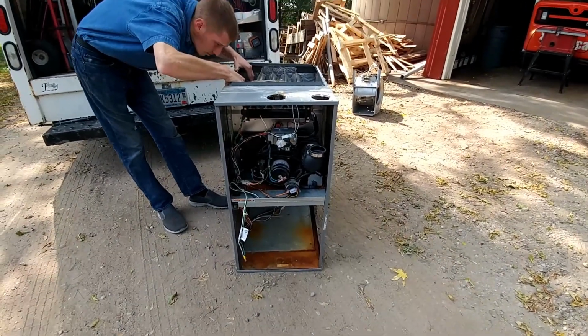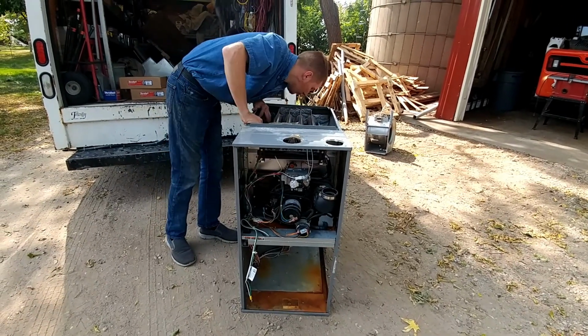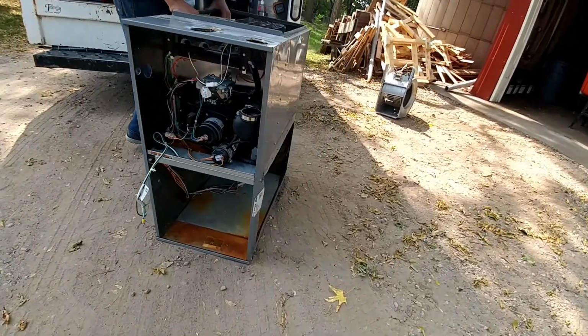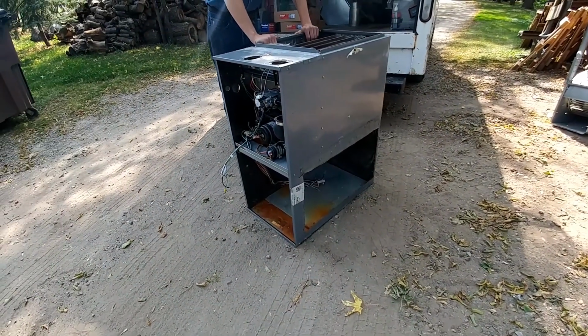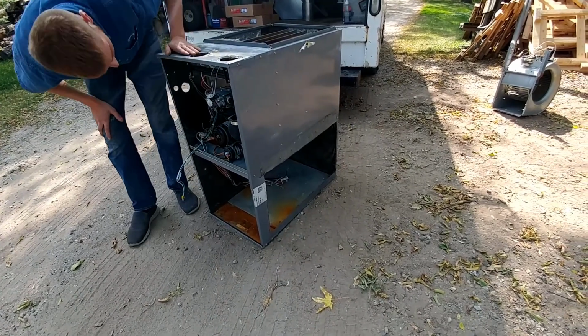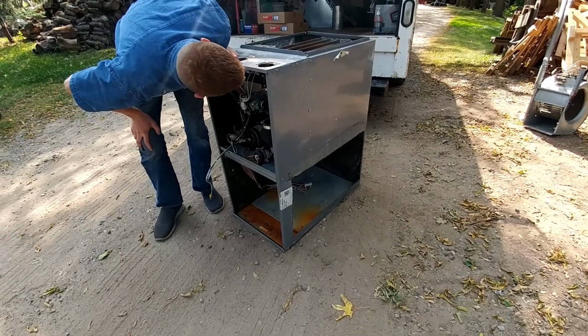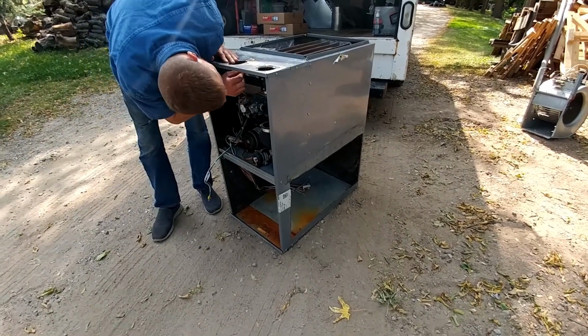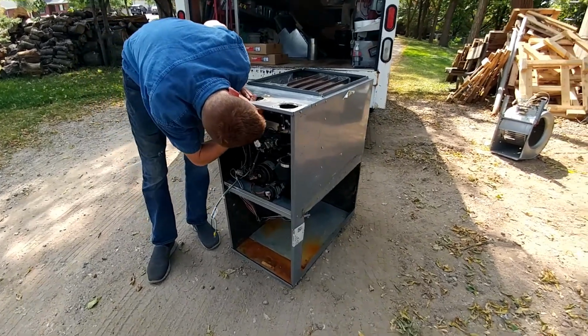It would have been nice to know what the static pressure was with that 16-inch filter on here. Well, what's static at that job? 0.4. Wow. Yeah. We had 0.2 in the blower compartment, and then when I hooked up the other side of it, I called it before it even happened because I know that filter's a 0.2. Wire was melted too. Yeah.